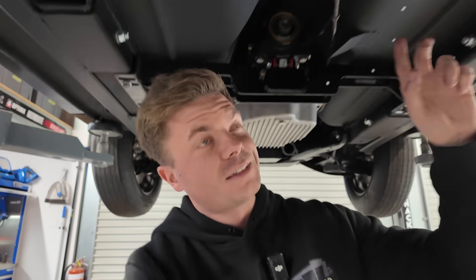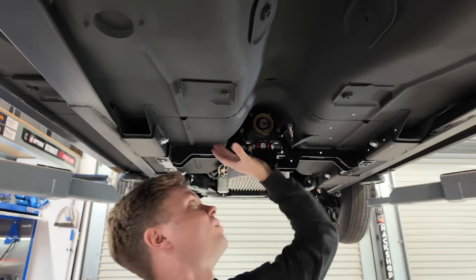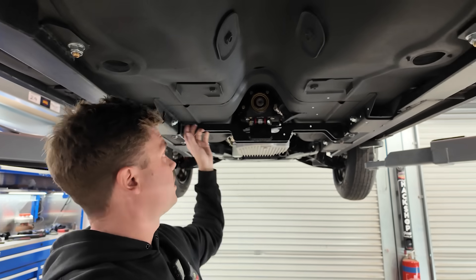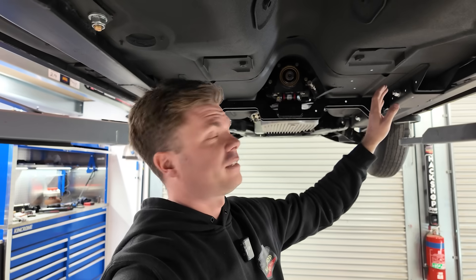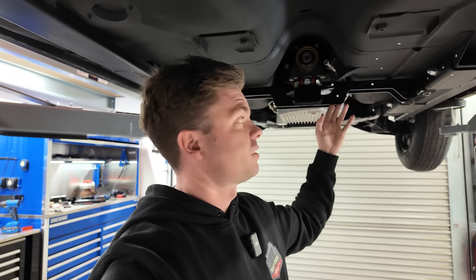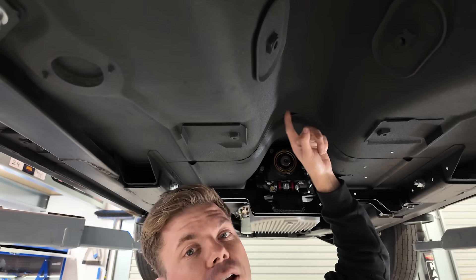Now I want to look at something bigger - I want to see whether I can scan the floor of this Torana, just behind the transmission. One of the things we need to do in the future is build a cross-member that goes between these chassis strengthening kits we put in a couple of weeks ago, and at the same time incorporate a tail shaft loop - all one piece, out of plate steel. I want to scan this floor and this arch because I need to know how far up I can go with the tail shaft loop and follow the floor as close as possible. The tail shaft in this thing is going to be pretty big with not a lot of room, so I need to scan it, get the data into CAD, and build my design around that exact floor.